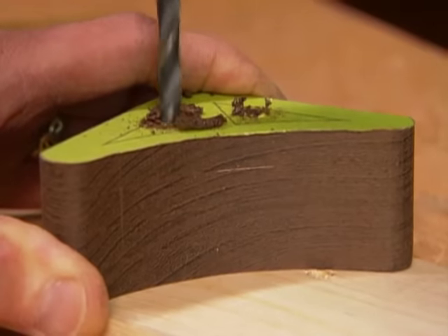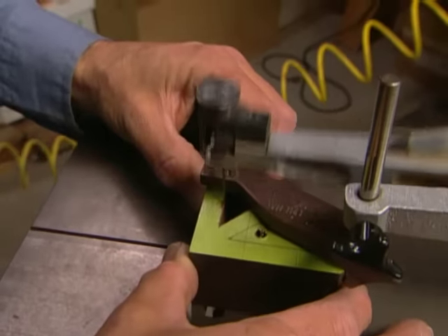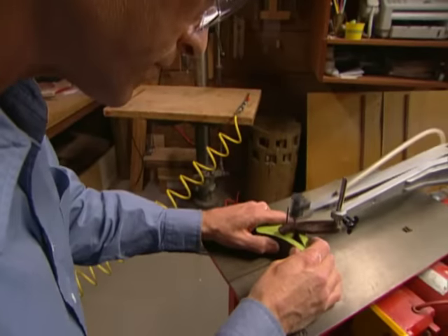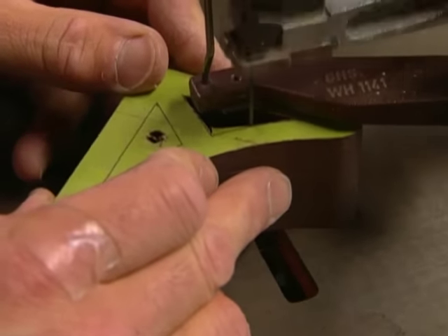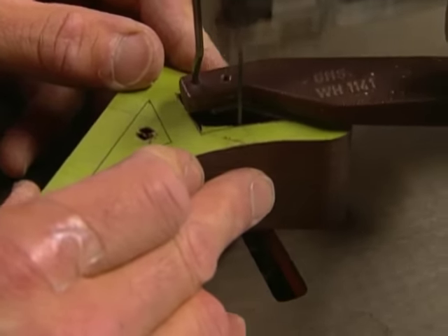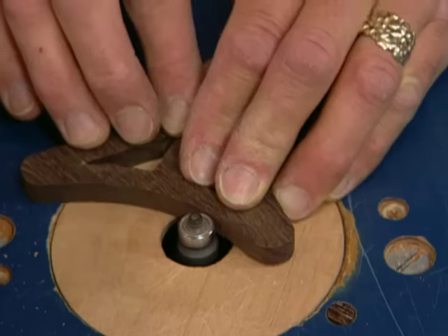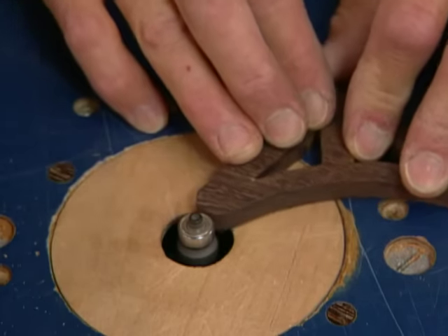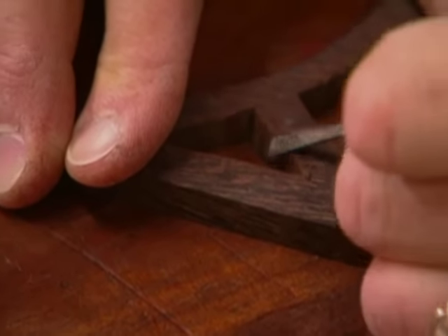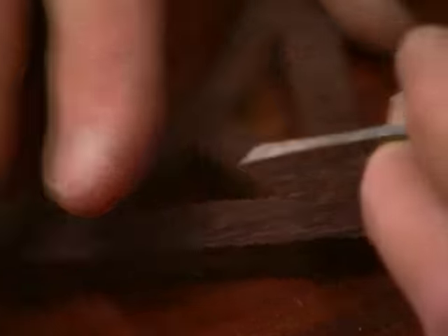Next, we drill a pilot hole in our stack. After threading the blade through the pilot hole, we use the scroll saw to cut out the interior triangles. Wenge is a very hard wood, so it's important not to rush because you might break the blade. Next, we round over the outside edges on the router table using an eighth-inch radius bit. Then we use a very fine Italian riffler file to round over the inside edges of our accents.